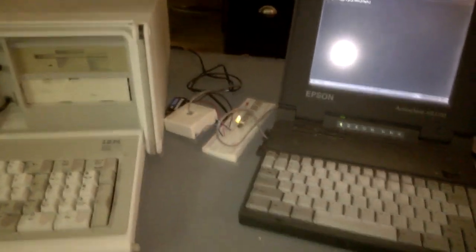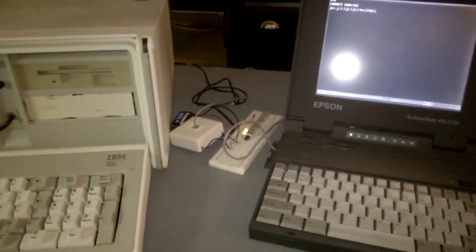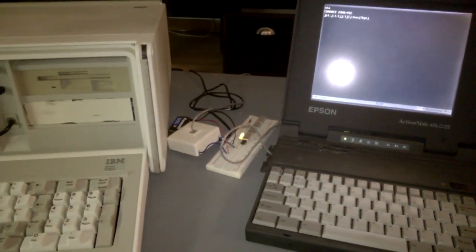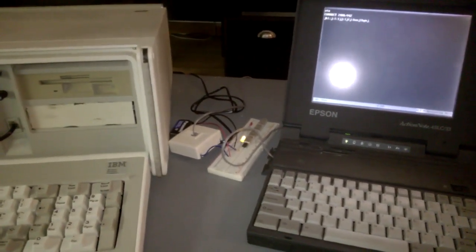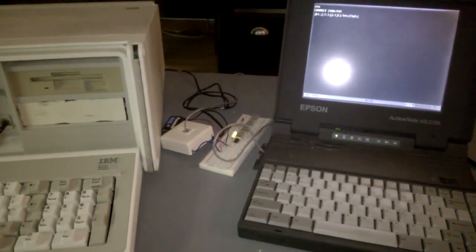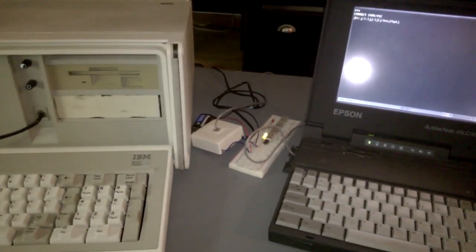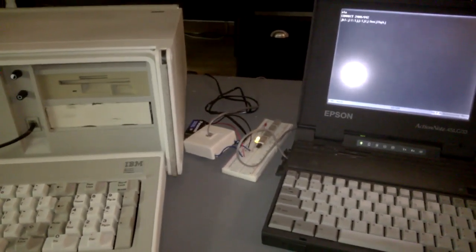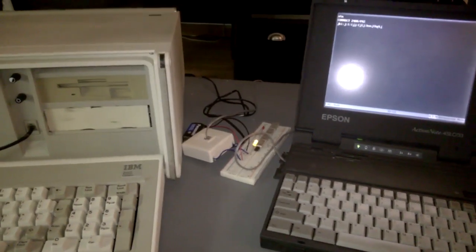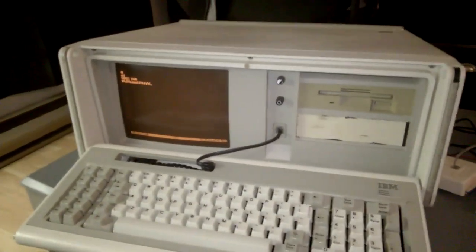And it's called a null modem cable because it essentially provides the functionality of a modem connection, but there's no actual modems. Instead of going between two modems connected to serial ports, it's just skipping the modems and going directly between the serial ports, referring of course to early modems which were external and connected to the serial port of the computer before internal expansion card modems started becoming more commonplace.